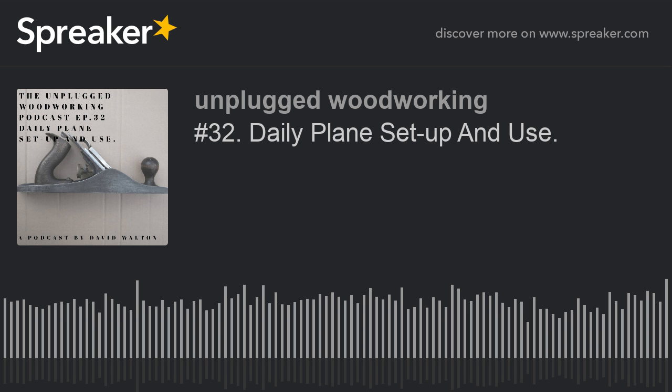I go to that if I've got really bad gnarly grain, or I'll just use a hand scraper, just what you use in your hands. The only problem with that, if anyone hasn't used one, is that they can get quite hot. You can buy these little, I guess you would call them thumb guards. I've never used them, so I don't know what they'd be like. But ironically, I'm looking at my thumbs now, and I've got two holes in either thumb where there were blisters, and the skin's coming off. So yeah, they do get really hot.